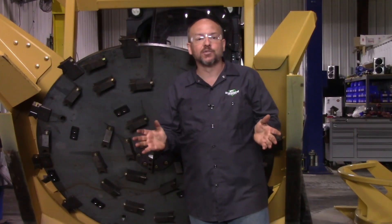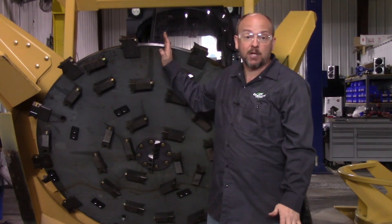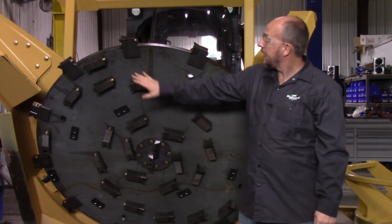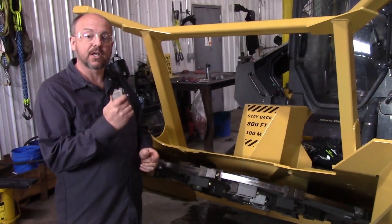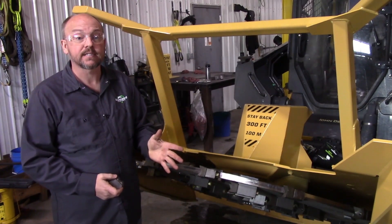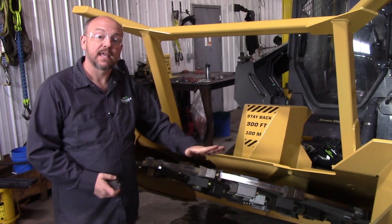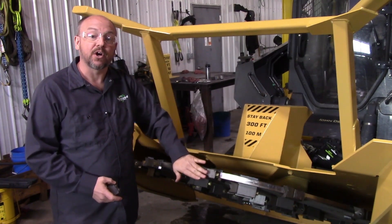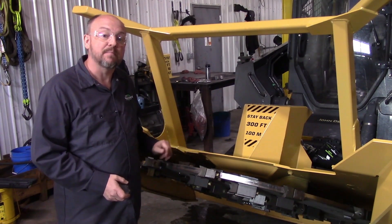You can also run the twin mall on the Diamond disc mulcher. You can install our carbide teeth on the bottom of the disc in any position except for the outside teeth. The carbide teeth are great for protecting against ground contact and unseen rocks, but are not nearly as productive as the sharp four-point teeth. These hardened steel teeth are needed on the top and perimeter to efficiently slice through trees and mulch using the cut and feed method.